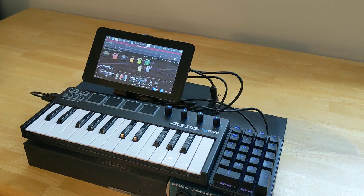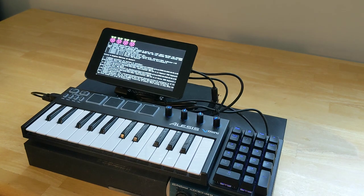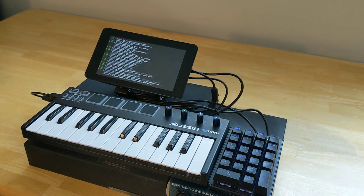For live performance, I can connect to Reaper's web UI via a browser, and this allows me to trigger playback tracks, automation, and lighting on our playback machine that sits at the back of the stage. The operating system loaded on the Raspberry Pi is Patchbox OS, and that is an operating system that out of the box comes ready for low latency audio. It has JACK set up, MODEP for the guitar modeling. It also allows you to load Pure Data patches and tons of other little goodies that you can find in there.